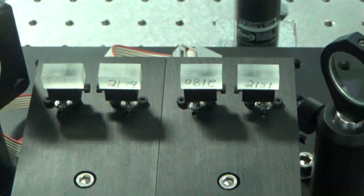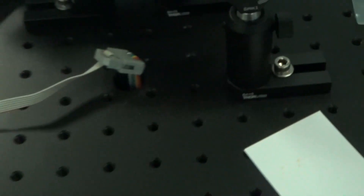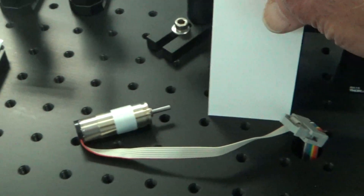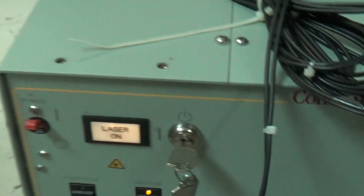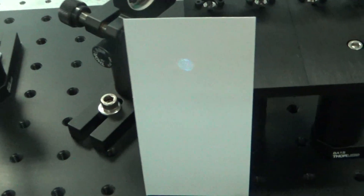The crystals are all at normal incidence right now since I'm operating at a wavelength of 745 nanometers. The back burn also shows a still well centered beam. Since the beam is not burning the paper, I'm going to turn up the energy a little bit more — this will make the beam slightly smaller and more energy will be coming out. At 1.34 kilovolts, that would be a very safe beam to work with — I can leave the card resting in the beam and it's not damaging.